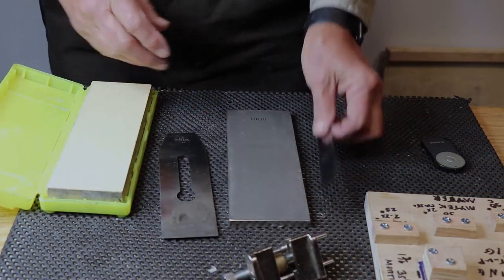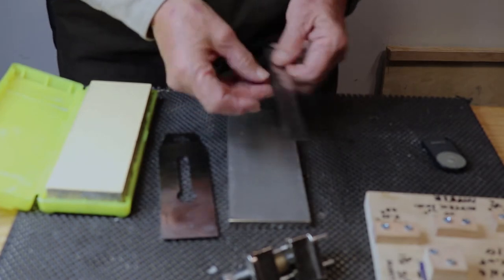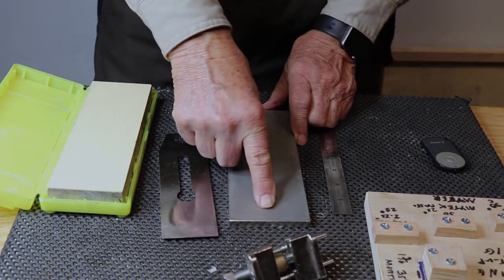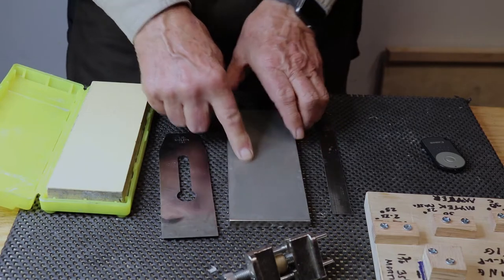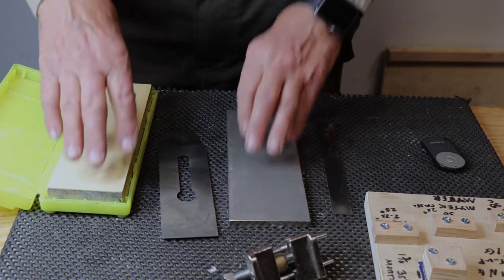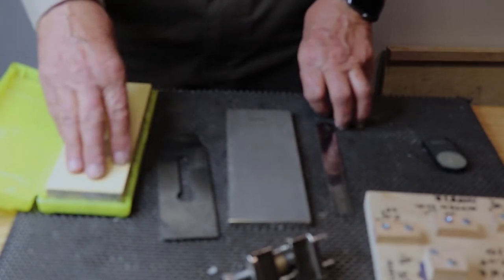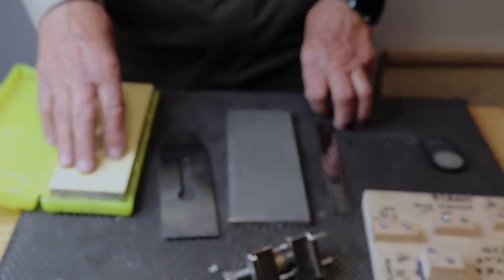Here's what we're going to need: a little metal ruler that's 0.5 millimeters in thickness, and a sharpening stone of some sort. I've got a diamond stone — we're going to need a higher grit level, such as in my case a 12,000. You might have 8,000 or 6,000 or something similar.